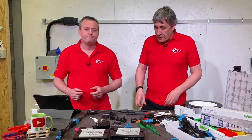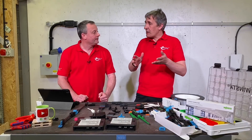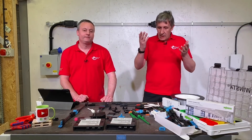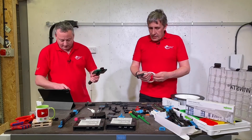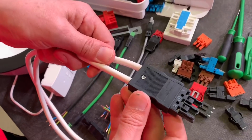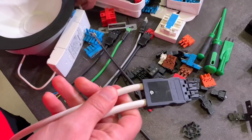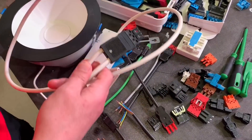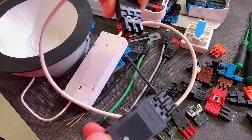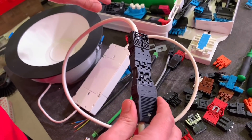There are also mounting blocks and accessories to fix connectors to surfaces. When it comes to power distribution, there are lots of options. One is a loop-in, loop-out arrangement — bringing in a switching line, neutral, and CPC and going out to the next fitting. For example, if you've pre-wired a downlight — possibly done off site or even pre-wired by the manufacturer — you just plug it together.